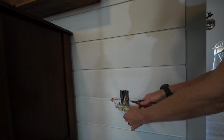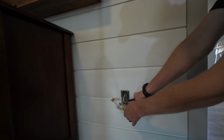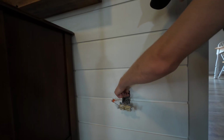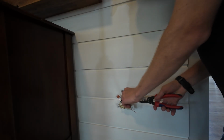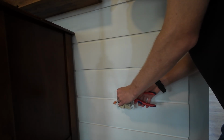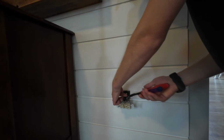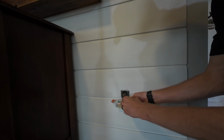Now let's do the same thing with the white and the black. I'm going to start with white. Just going to cut them off, it's easier. You just need to strip off probably about 3/4 of an inch of insulation. Straighten it up. These Wagos, they just lever action up. That's why I love them. Of course, they're in the description.